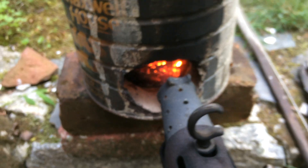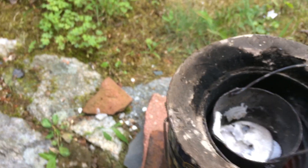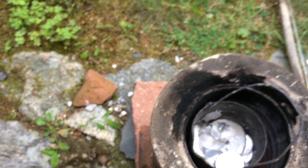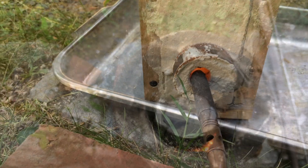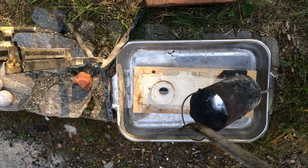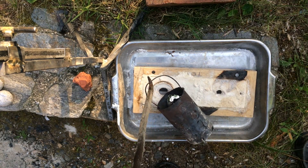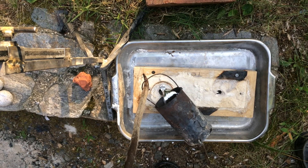When the aluminum is finished melting, which can take over an hour, I recommend preheating the mold for about 15 minutes before pouring to drive out any moisture and to prevent clots from forming during the pour. I find this a good time to stir the aluminum and remove any slag. I pour the aluminum into the mold, continuing to pour steadily until some metal flows out the overflow hole.